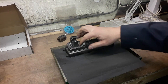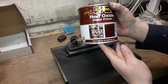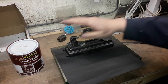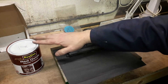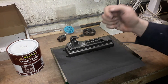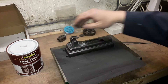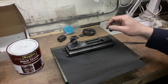I'll show you the painting - quite simple. What I've used in the past is this stuff from Rustins - it's actually a water-based primer, you only need water for cleaning your brushes out. I've used it quite a bit on cast iron and it works a treat, but I've even used it on aluminium - it doesn't say it's for aluminium, but I tried it on an experiment, then painted over it, left it a month or so, went back and it was rock solid. It didn't flake off or anything. So if it goes wrong, don't blame me!